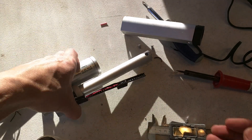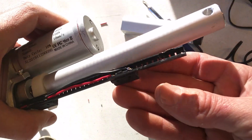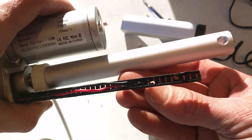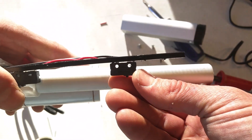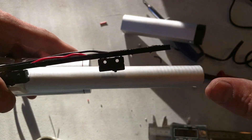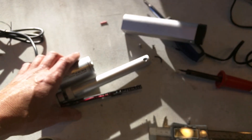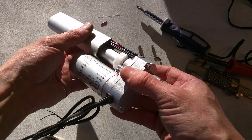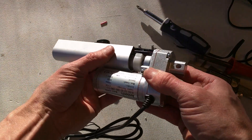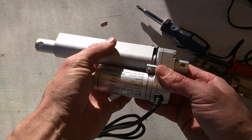I got my diode back in there — it still has the diode. Now I just need to put it back together. Make sure the wires aren't sticking up, because there's no insulation here and the case sits right on top. It slides back into that little channel.